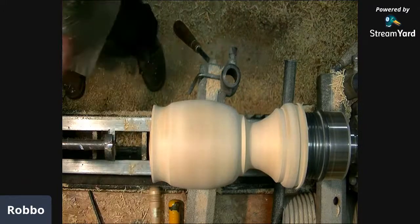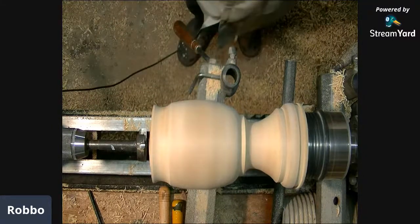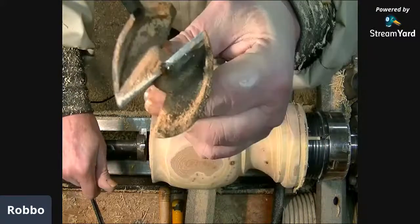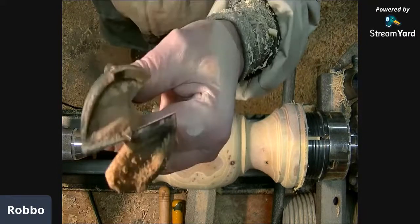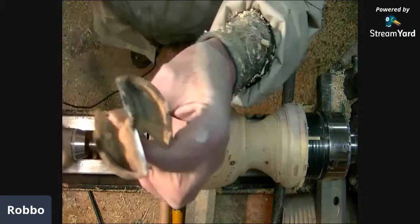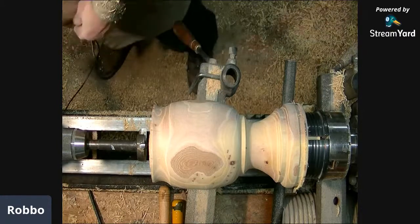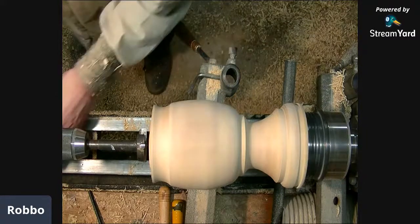Right, let's drill a hole. Now I'm going to up the speed here. I'll switch it off just for a second. I'll explain why. Our drill bits are tungsten carbide. Now, this was before you could actually buy tungsten carbide Forstner bits. We actually had to have them made like this because we used to drill a lot of treated pine posts and things, and a normal Forstner bit would drill about 5 to 10 holes, and that'd be the end of it. These drill over 400 and are still sharp, but they like more speed than you normally use with a normal Forstner bit, before anybody complains.